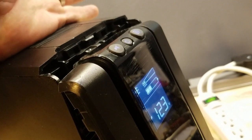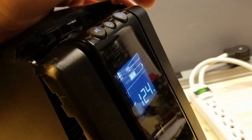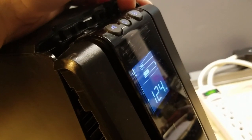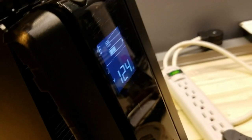I've had APC battery packs apart like this before — the battery can be really weak and depletes its voltage really fast while the other one's just fine. I think I might crack this battery pack open and check each of the individual 12-volt batteries, because I can put a load on them individually. We'll see how each one behaves. That may be video number two because this one's getting kind of long. We're gonna point back towards the battery pack — maybe APC sent a bad battery pack, but who knows.